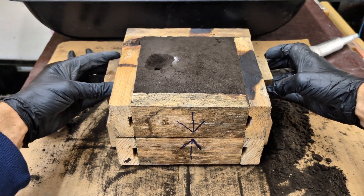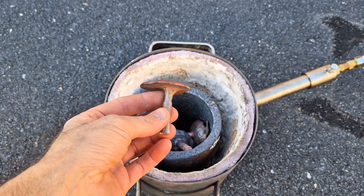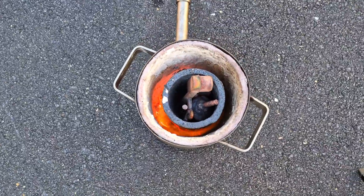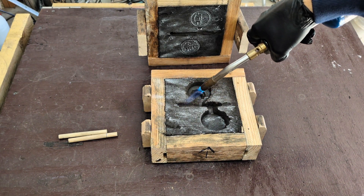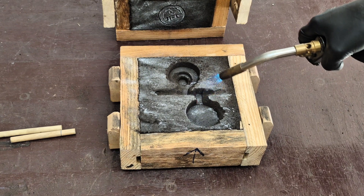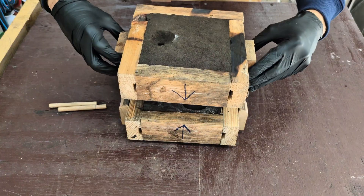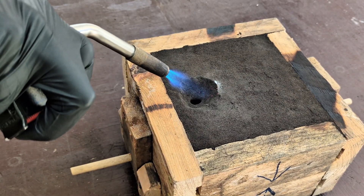It's raining outside today, so I'll have to wait a few more days to do this. A few days later it is nice outside and I'm going to be melting down some copper in my propane melting furnace. While that is melting the copper, I'm going to preheat this mold with a propane torch. I have learned that doing this gives you a much better result when finished. Make sure to preheat the bottom and the top of the sand. I also have these little pins I put into each side — this holds the top to the bottom so it does not come apart.